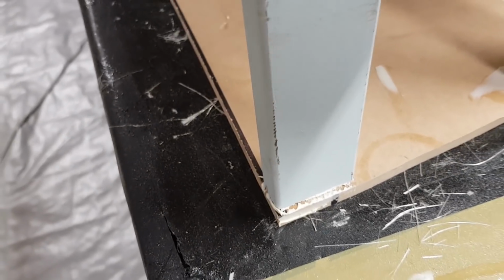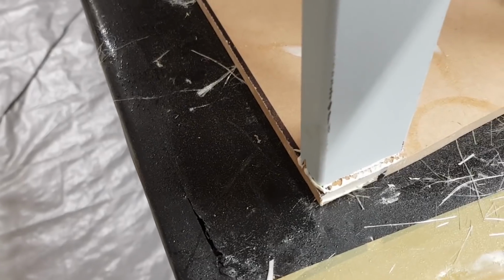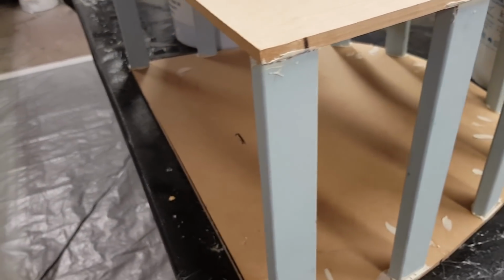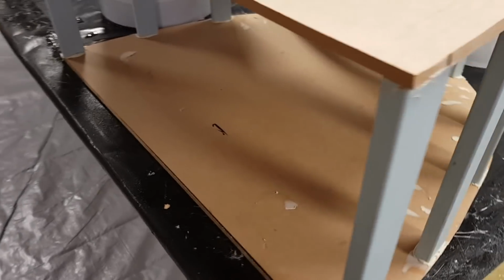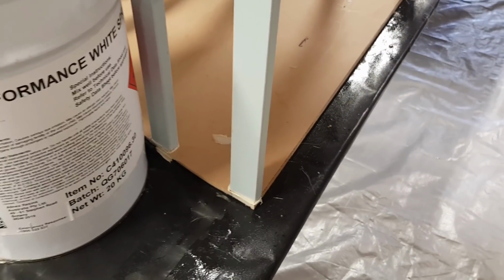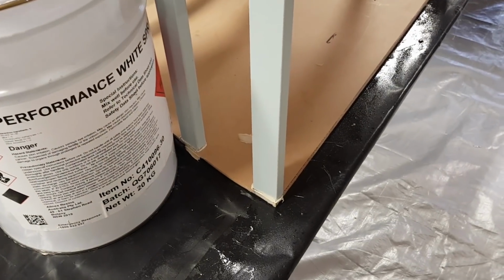By doing that, the gel coat will be flush with the outside template there, and then I'm going to round off the MDF probably with a router, because I want a beautiful radius on this, and I'm going to brace this up once it's all glued and set, once I can get to it and make it a bit easier to work with. But I don't want any sharp corners inside this mould, and you want to ensure that you're going to get good release. So that's the plan.